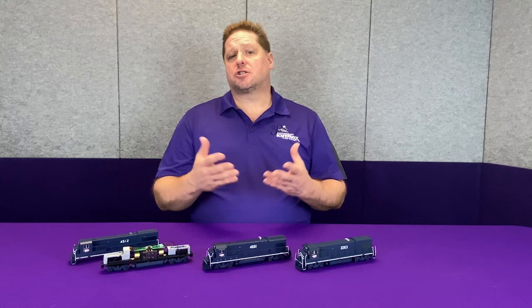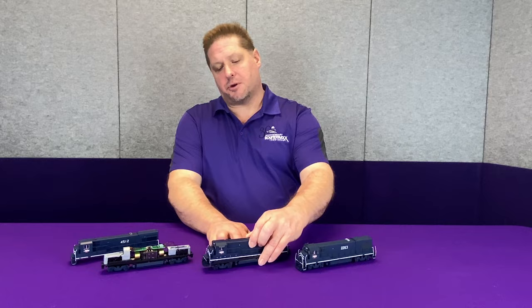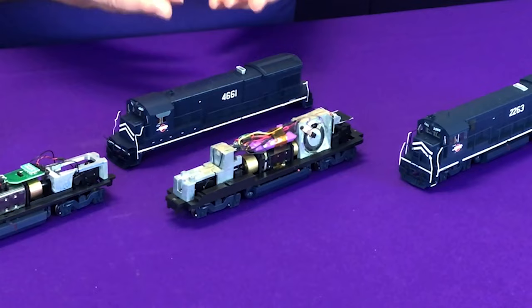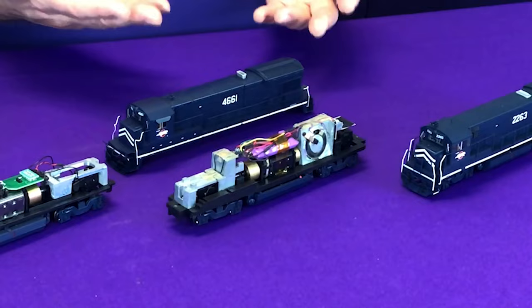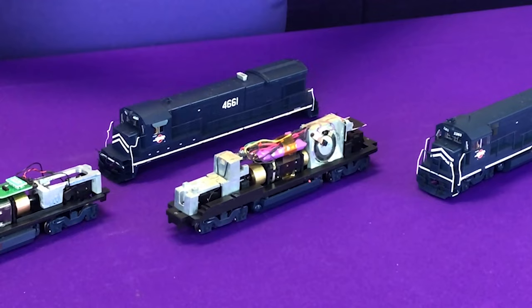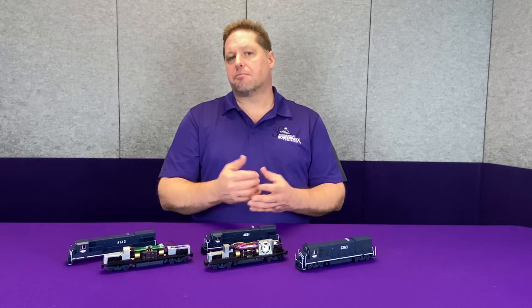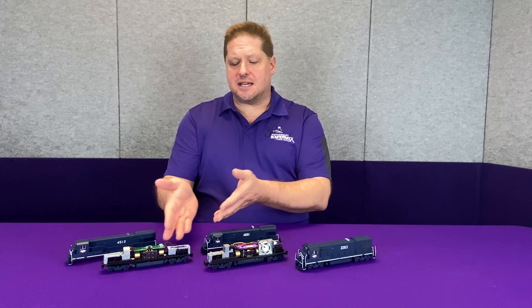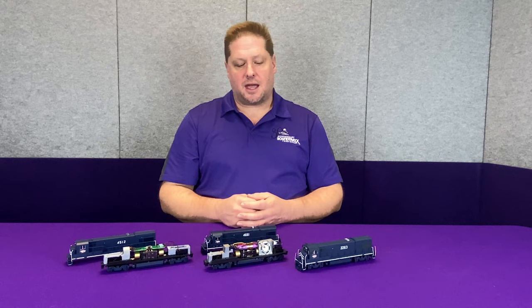As the years changed, this B23-7 has a very similar wheelbase and chassis but is designed quite differently. Removing the shell, inside you can see I have already installed an original Tsunami and it's waiting on my workbench to upgrade to the Tsunami 2. There was a small circuit board where the Tsunami decoder has been wired in place. The biggest difference here is that this model has an A-frame for 30mm round speakers that basically straddle the driveline. This model does not have room to mount a P&P style decoder, which is why we had to hardwire it. In modern day you would use a TSU-2200 in its place — there's actually room for two speakers wired in series, then you place your TSU-2200, wire everything up, and you're good to go.